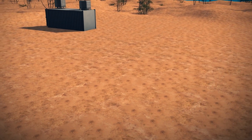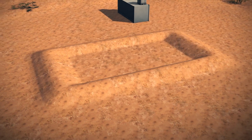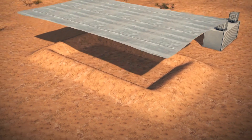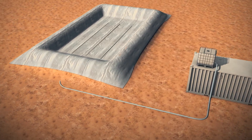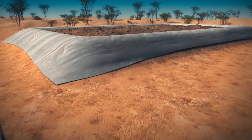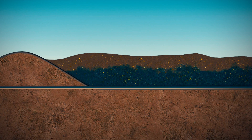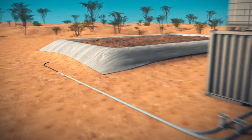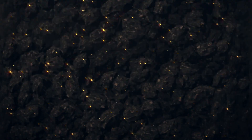Jake's vat leach method is a six-stage process. First, he constructs a huge rectangular dam from dirt. Stage two, a massive plastic sheet creates a waterproof basin. Then he installs a perforated pipe system before stage four, when he fills the vat with gold-rich tailings. Stage five, he pumps a chemical solution through the pipe system and allows it to soak for two days. Once the gold is dissolved, he pumps the liquid into a drum where the gold specs bind to lumps of carbon.